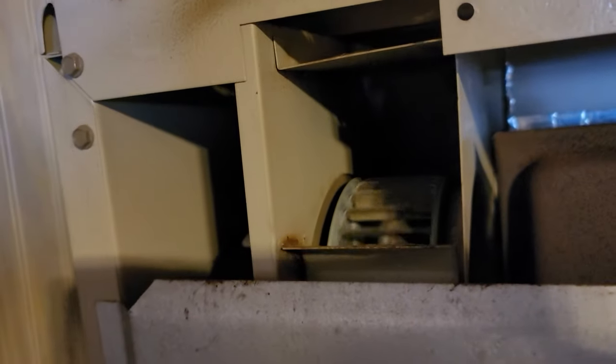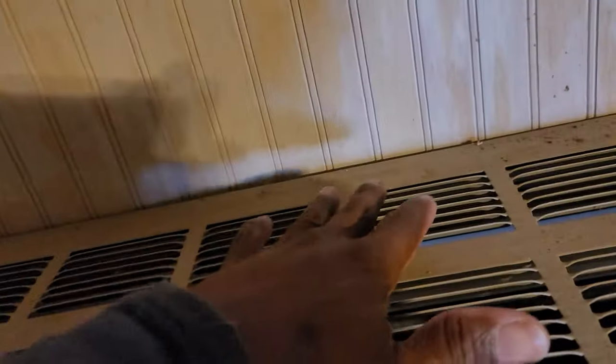Now you close this — you don't leave the window open. Close that. Tighten the wing nut. Once this whole unit, the rusty-looking stuff, heats up — that's where the flame is enclosed. There's a thermostat right there that senses the heat. This is the fan control, the blower control — that's the blower right there. Eventually, once it gets up to temp, that will kick on and it blows air out here. With the cover on, it almost creates a positive pressure within the unit, and hot air streams out of these vents and the top.